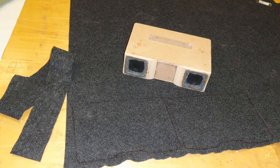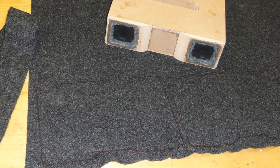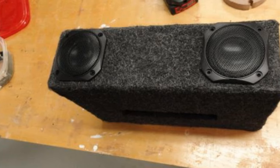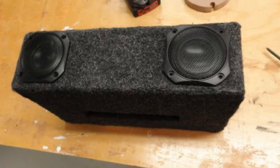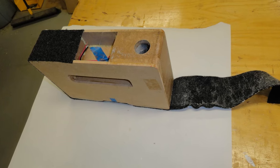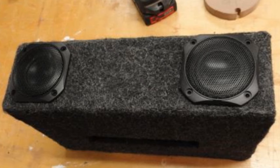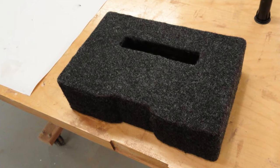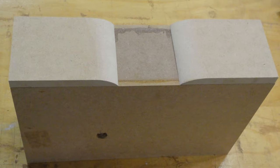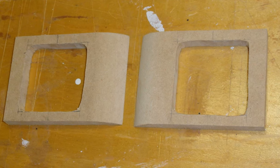While I'm talking carpet, this is the unbacked speaker carpet I'm using. Basically, if you can hold it up to your mouth and blow air through it with no restriction, it should probably work fine for this. I traced out the shapes on the smooth side of the carpet and cut carefully with an exacto knife. My friends wanted one with grills on it — it looks more speakery that way. If that's the case, you just measure or trace, cut the carpet, and then use contact spray adhesive on both the carpet and the cabinet to apply it. Install drivers, add the grills, and you're ready to go.